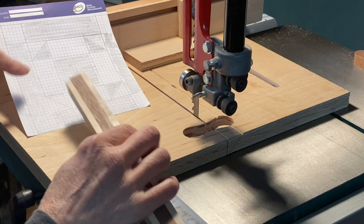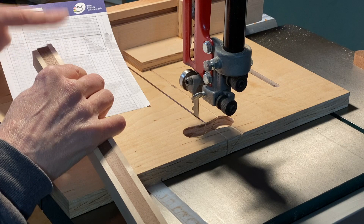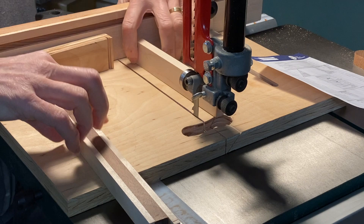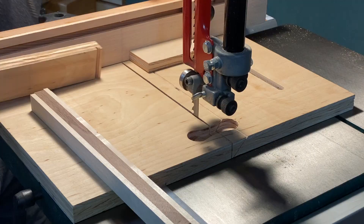For the center sections with the thicker, darker piece in the center, I'm going to be squaring off the end using the same thickness stock that I planed out for the center, because I want that to end up square as my guide for where I set the stop. It is a good idea to vacuum out the dust and chips that end up on the top of the table periodically, because anything that gets in the way can throw off your measurement of your angle.